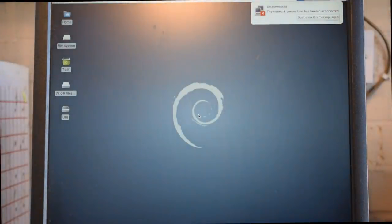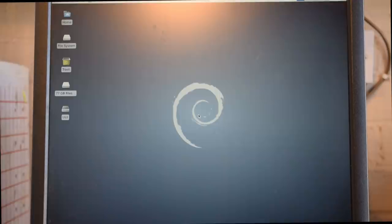There we go. So we've got LinuxCNC up now. First thing we need to do is run this latency test. One thing I'd advise as well: don't have it connected to the internet. I don't have any of my CNC machines connected to the internet, because for me they're just CNC machines, and I get all my G-code on via little thumb drives.